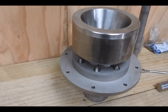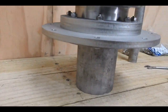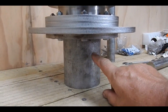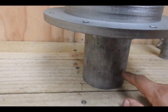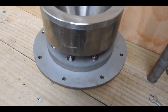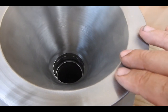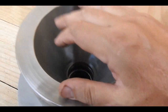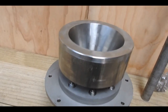Here it is: the burn cone, structural support, and reduction zone. I need to put that on the lathe — being so small it'll fit on my lathe without too much fuss — to make a bit of a cone there, so it opens out more at the bottom than at the top. At the moment you're looking at a giant version of this, which has to be coned to prevent bridging. Down there we have what looks almost like an aircraft toilet in stainless steel. Charcoal goes in there, big burn going on in here, nozzles sitting about there. It's going to be wood gas bug central — party time.